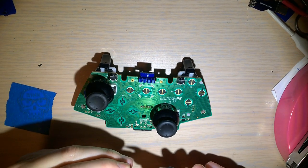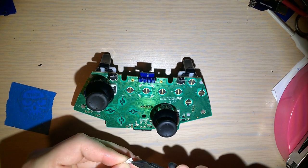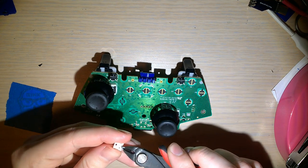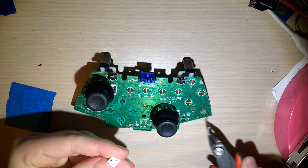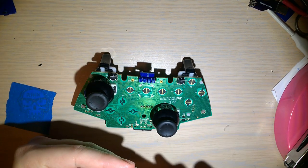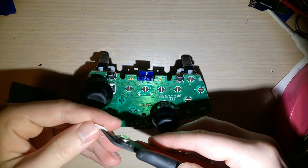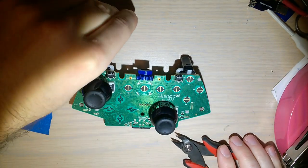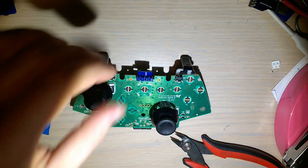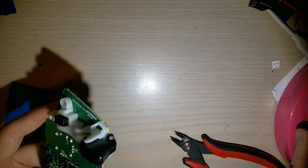Anyway, I'm gonna go ahead and get these soldered so I can just double check that it's working as far as with a USB-C host goes. Then I'm gonna go ahead and put this thing back together and we should be all good to go. These things are designed for a machine, not exactly a human, as far as this cut tape packaging goes. And these things are impressively small. These are 0603 resistors. I'm gonna go ahead and try and solder these on.